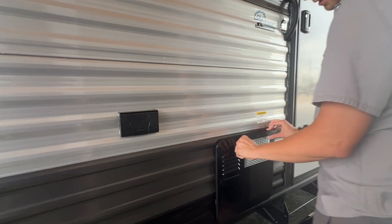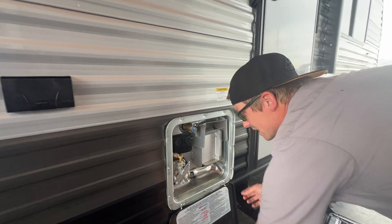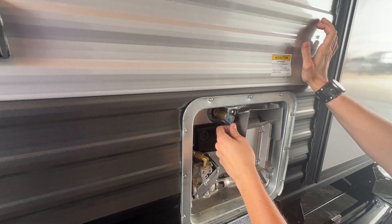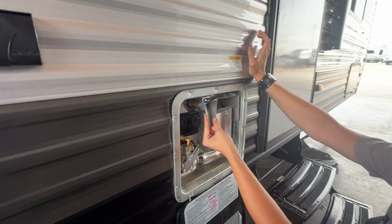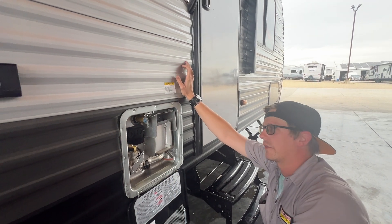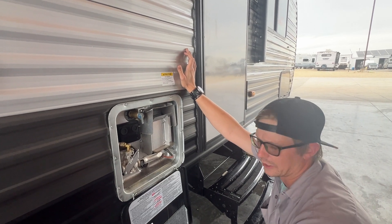This is your hot water heater. You're going to undo that spring-loaded clasp to open it up. This is your pressure release valve. You have reset buttons here in case it doesn't light, and to tell if there's water in your tank or pressure built up that you want to relieve, you're going to tug back on this little metal rod. You're going to hear a hiss if air is escaping, and once water is coming out at a pretty steady rate, then you know it's okay to go ahead and light your hot water heater.